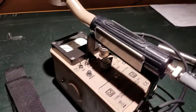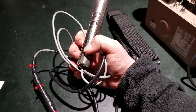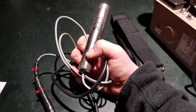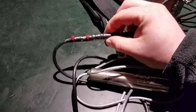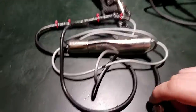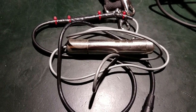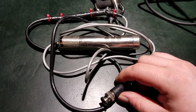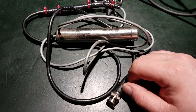I've also adapted an old CDV-700 probe. The CDV-700 Geiger counters are the yellow ones you always see in movies when they're trying to scare you about radiation. What I've done is modified this probe to have a one-megaohm anode resistor and a BNC cable connection, because these things normally hard-connect directly into the meter without the ability to swap the cable.